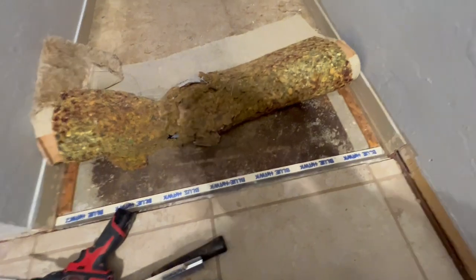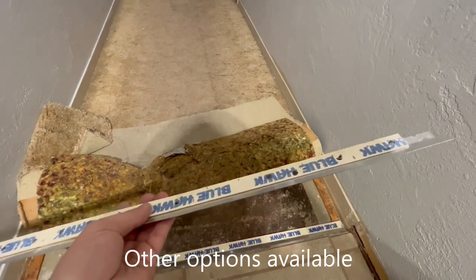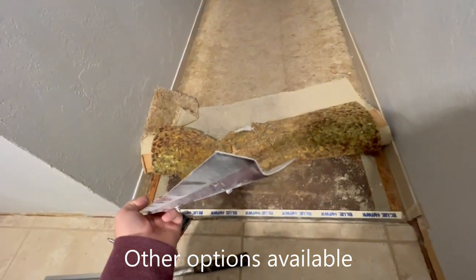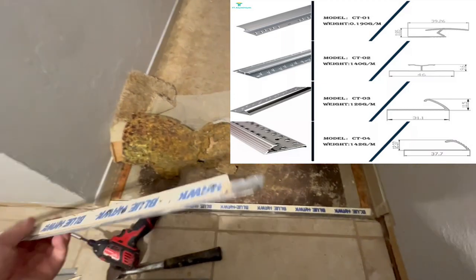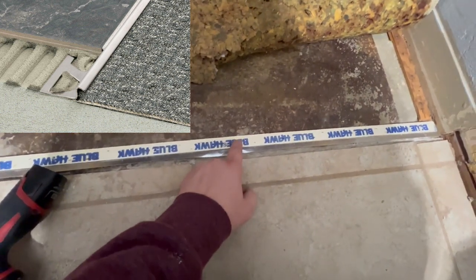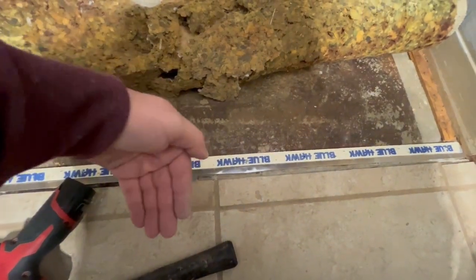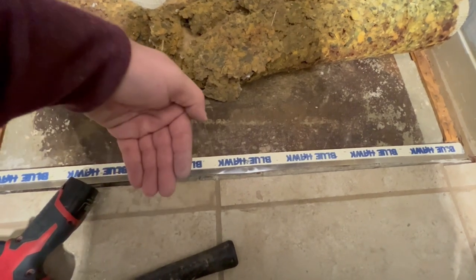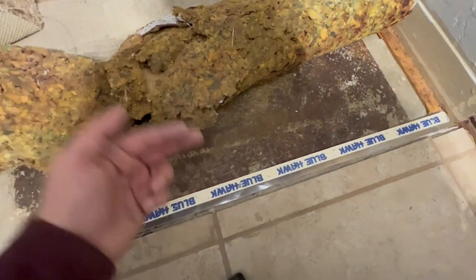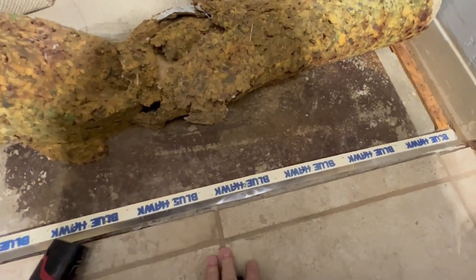This is what's recommended for your carpet — basically it's a flat piece of folded steel in the shape of a Z, called Z-bar. You have your tack strip on here, with the tacks facing this way, so when the carpet slides over it, it hooks — and when it pulls back it hooks. There's a big enough gap so your carpet, once it's folded, can tuck underneath it.